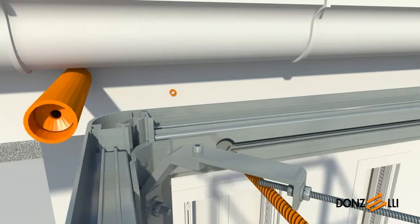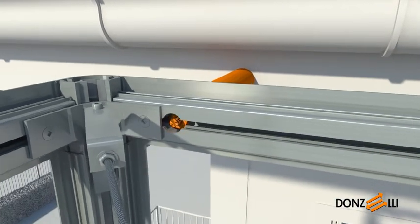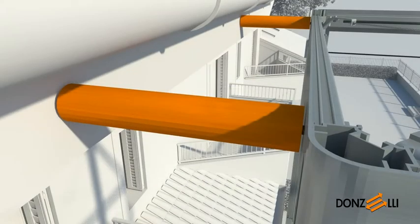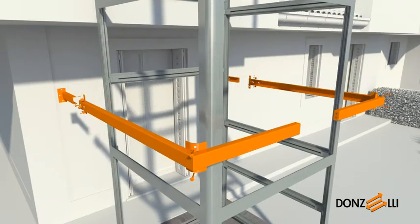In the installation shown here, the top of the shaft is secured to the eaves, which are about 10 cm away, by means of a special push-pull kit consisting of a threaded bar with chemical expansion plug and counter tube. The shaft is secured using the method already described. If required for the specific installation, a variety of structural reinforcement options are available, including struts, crossbars and bracing beams. On the installation shown here, a special telescopic tie is used to secure the free rear uprights.